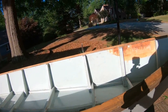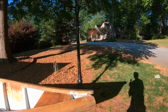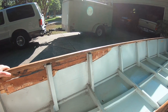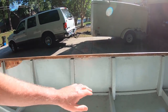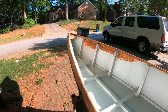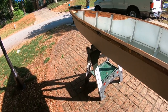Today that's the little project: I'm going to work through this during class. I've got to cut all this out, cut a piece of underlayment, put it here, glue it, clamp it, and put all this back. As you can see the only thing left on this is one thin layer, so I'm going to have to glue all this back and make sure we've got strength. I'm thinking what probably happened was it was caulked right up in here at the top and water may have gotten in — you can see it right here too. This just happened in the last couple of months while it was stored behind my house.